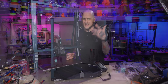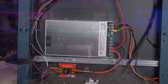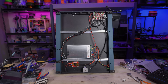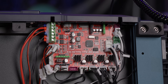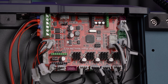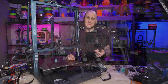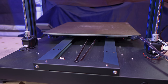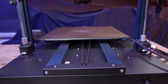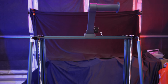The electronics box is pretty thoroughly enclosed, so you're not getting filament dropping into it. Inside there's a 500 watt 24 volt power supply. In the corner of that box you'll find the main board — an Elegoo version of a Robin Nano board with an ARM 32-bit processor and quiet stepper drivers. If you look closely, it only has a single Z axis stepper driver. On the back of the Z axis, we find dual Z motors, so they are synchronized and cannot operate independently of each other.